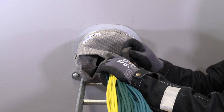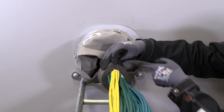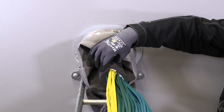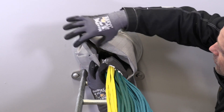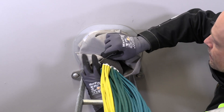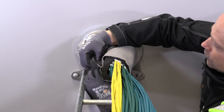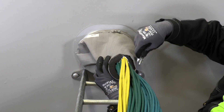Make sure there are no gaps when joining the bundle. Fold the sealing strip around the bundle and over the sealant, making sure there are no gaps in the joint. Pull out the cloth flush with the sealing strip, and if necessary, fold the excess cloth material for a tight fit.